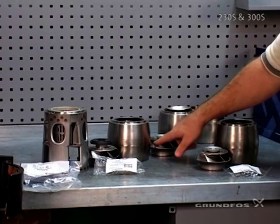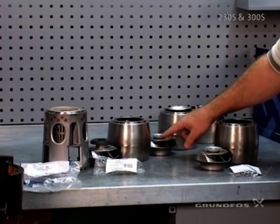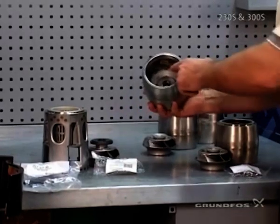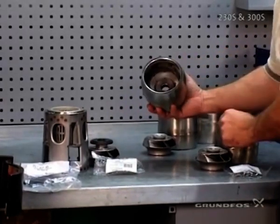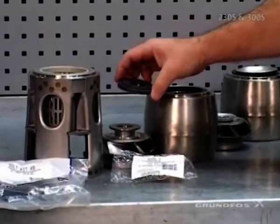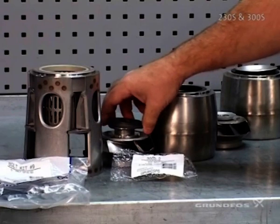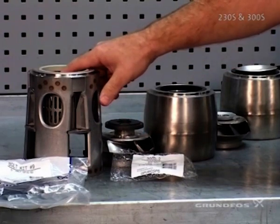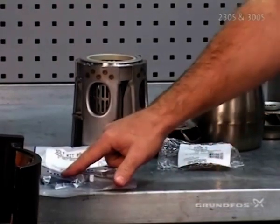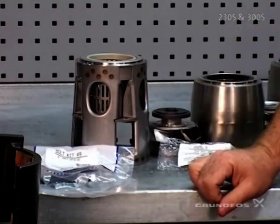There is a full diameter impeller, which comes all the way out past the outside area of the sleeves or skirts of the impeller. Then we have your lower chamber, which has an up-thrust washer on the inside of it, and it must always engage on top of the up-thrust or spacing washer inside the unit. There is the pedestal, another full impeller, your inlet piece, along with the seal ring, the screen, and then the motor bolt mounting package along with the cable guard and cable lead protection guard inside the package.